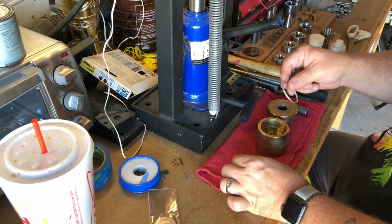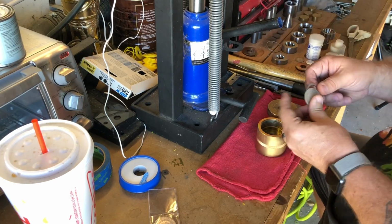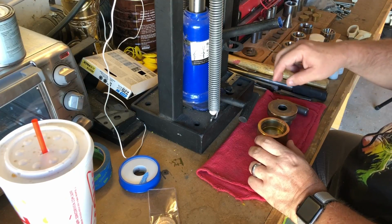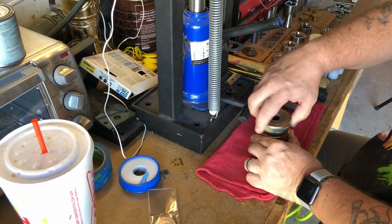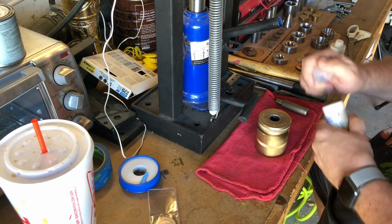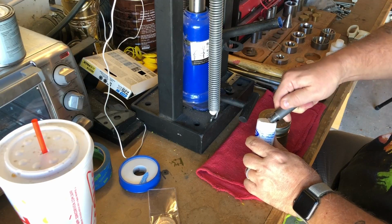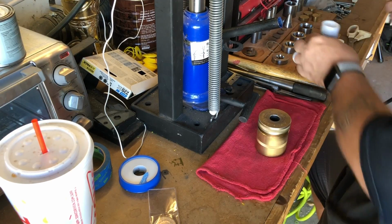Using Jason's Works punch, made specifically for punching holes in coins, I'll start by putting the receiving part of the punch into the set, then a centering ring, then the coin, then I'll thread the top onto the punch. And now I'll take the actual punch itself and give it a little coating of some Pepe lube. This will pay off big time when it's time to get this sucker out of the coin, because sometimes it can be a real bear.